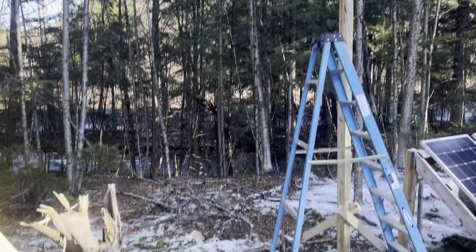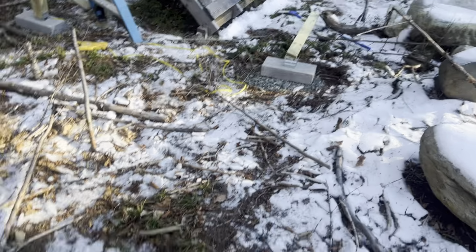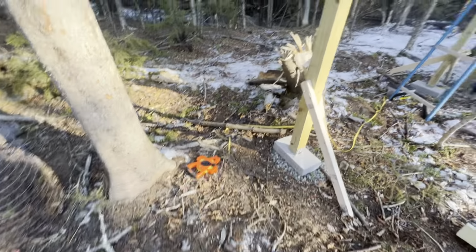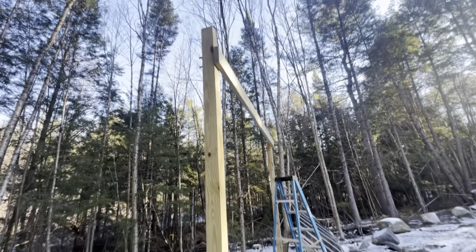All right, that's all bolted on. And I prepped 2 of the footings for the low side. I also cut 2 of the 4x4s to 4 feet because I know they're gonna be no taller than that anyways. And then the plan is, I already marked on this yesterday, but I know that these posts need to be 7 feet lower than these.